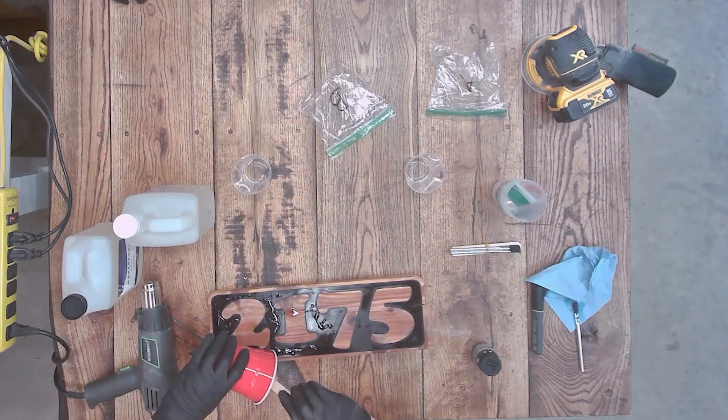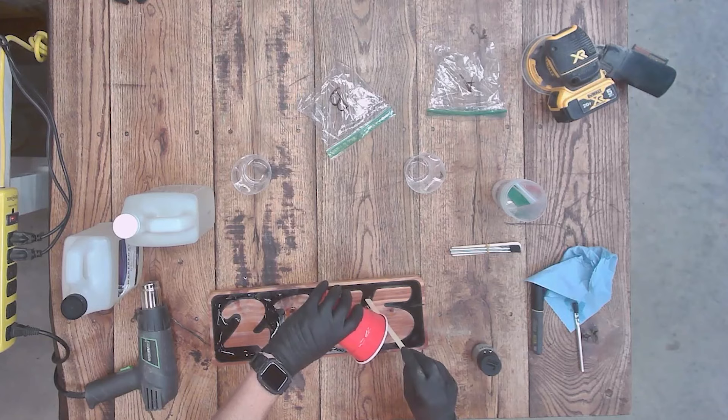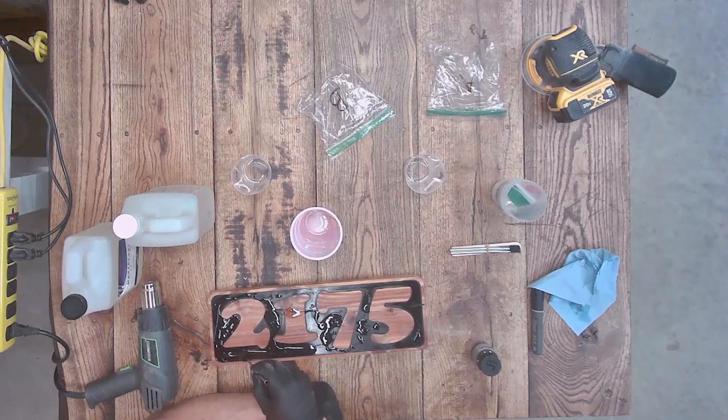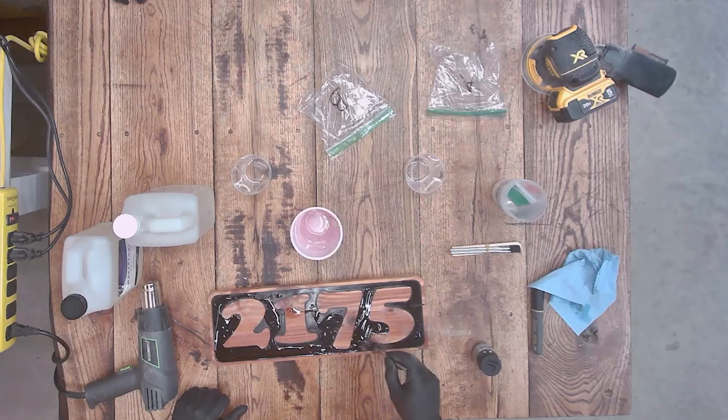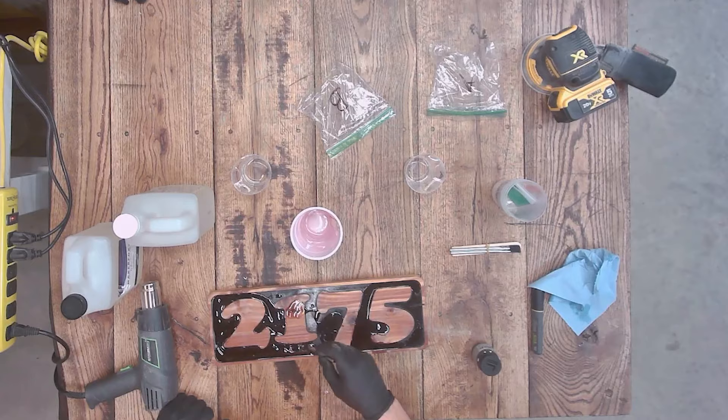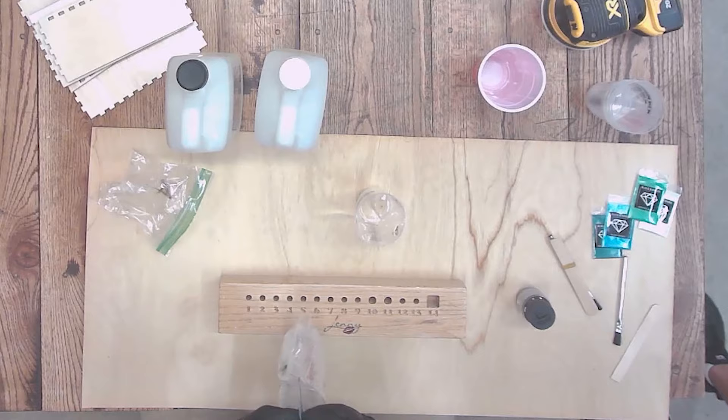Another thing I came up with on this little rough CNC project - you don't always have to use pigment. You can use spray paint in the background and then put clear epoxy across the top and you get a pretty cool-looking finish. It's not the same as using black pigment, but you can substitute different methods depending on the look you want - whether more pristine, rustic, or whatever. Your imagination is your only limitation with this kind of stuff.